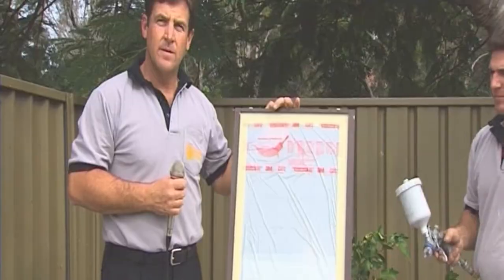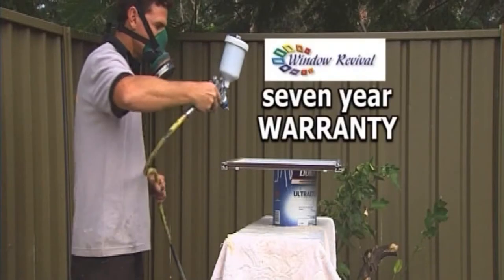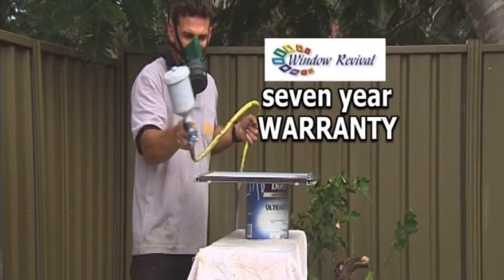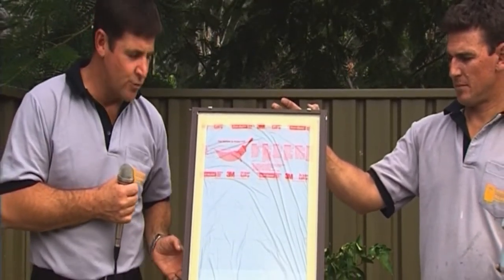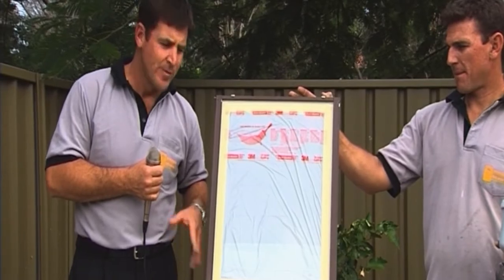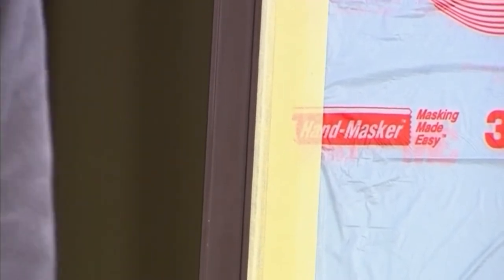Moving over to the thick sash to spray it now. A couple of little tricks — one of them is you always prime the side that doesn't have the felt first, then flip it around and prime the felt side. When you put the final coat on, whether it be a thick sash or a window, you always get a little bit of wrap-around overspray and you can't help it — the paint dries and gives that little bit of a sandy effect. But if we do it this way, the felt side sits on the outside and the screen goes in front of it. No one can feel it, no one can touch it, and no one knows the better. That gives you a nice flush, smooth finish.